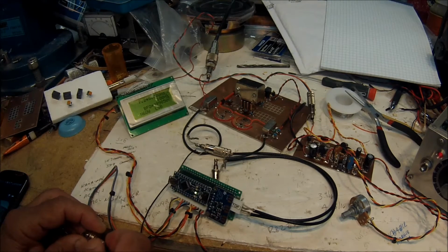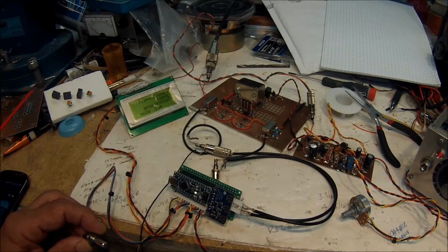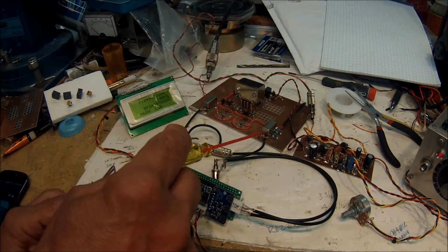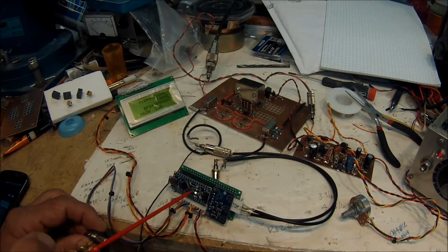There's some foreign broadcast, 7245. Again, there's nothing on the front end other than the antenna getting dumped right into the SBL1 receiver transmit mixer. The two bilateral stages here, another SBL1 product detector balance modulator, audio amplifier stage, the Si5351 PLL, which is developing two frequencies, a tunable one.